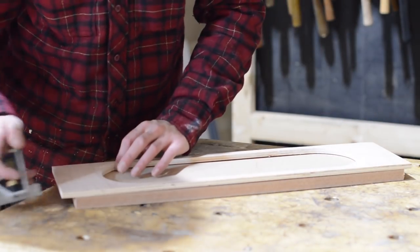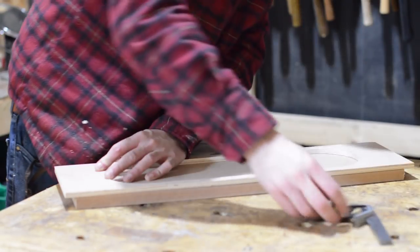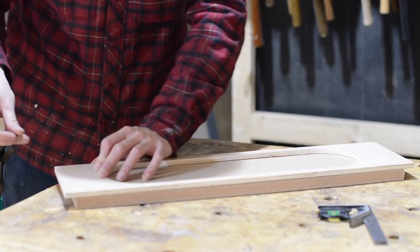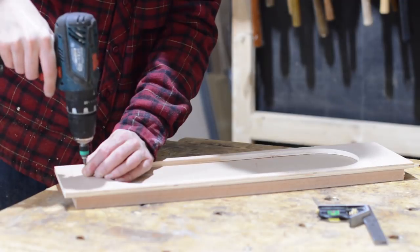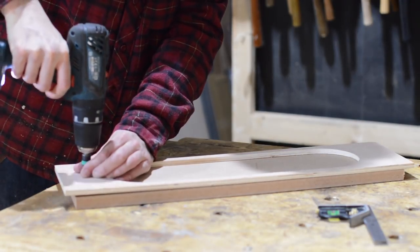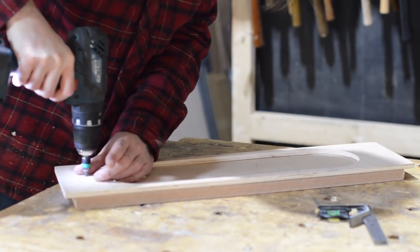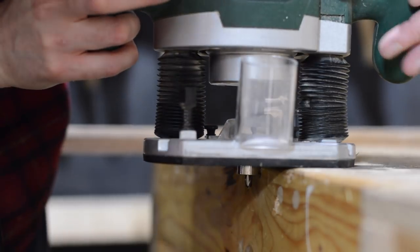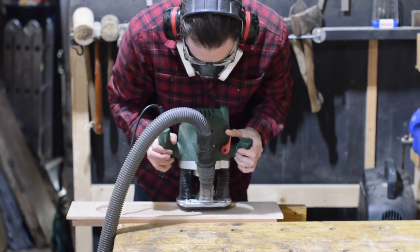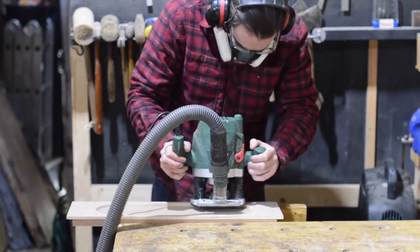These end bits are now slightly shorter than the template I've made, so I set it square to the thickness of the MDF and centre the template. If I was to clamp this in place it wouldn't give me enough room for the router to run, so I'm going to screw it down. When I go to put the bench together, all the bits with the screw holes in will be on the inside and won't be seen. In my router I fitted a spiral up-cut bit and a guide bush. The plan is that the guide bush will run alongside the template while I plunge down and make a cut.